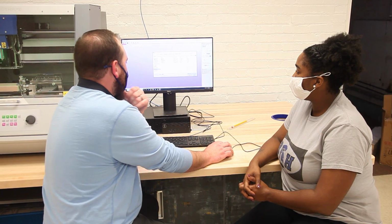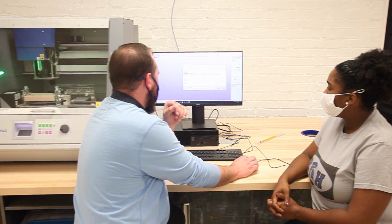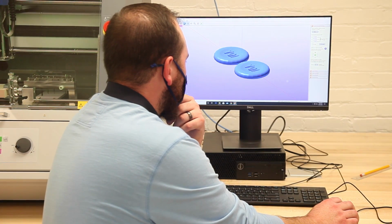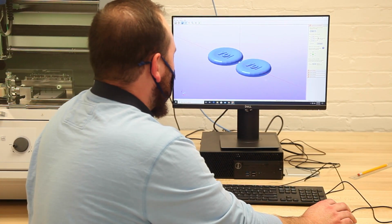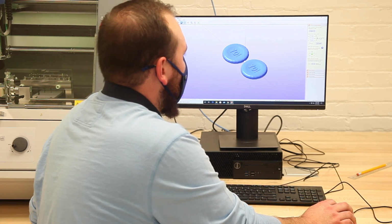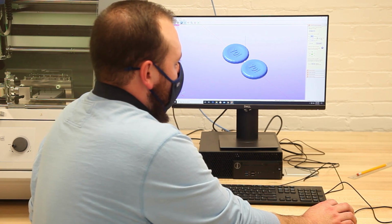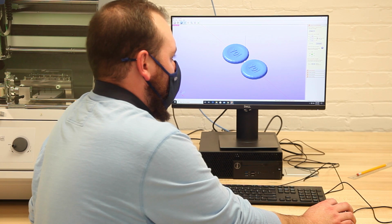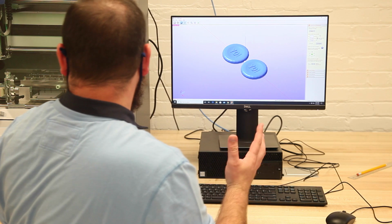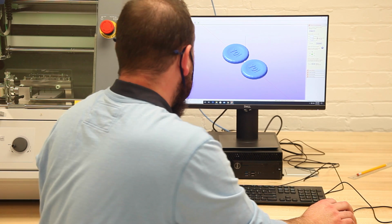We're going to click open, and we're going to go grab the download that I grabbed, which was the yo-yo, and hit open. It doesn't take long to import. By default, when you bring in the model, it's going to be whatever size it was designed as. But we can change it to make it the size we want. If you keep this checkbox checked for keep XYZ ratio, if you change any of these, it will change the other ones proportionally. Since we have a 6-inch piece going long ways, I would say we want to make our model maybe roughly half of that.